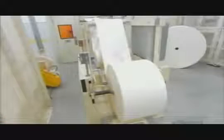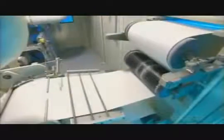They start with superabsorbent polymer particles, which drop into a forming chamber. Pulp unwinds into the same chamber. A spray of water helps suppress any static electricity that could interfere with processing. Inside, the pulp mixes with the polymer particles. The result is this fluffy absorbent material that will be the diaper core.